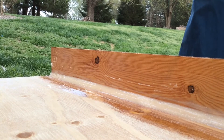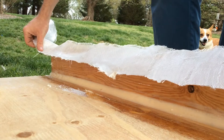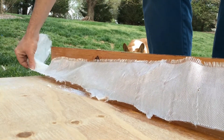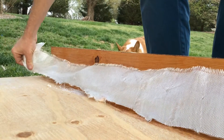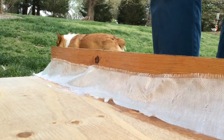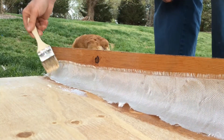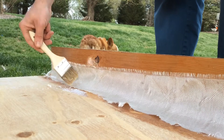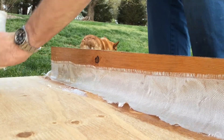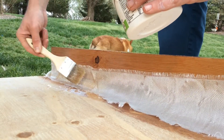That cornered angle thing that you just put in is called the fillet, and that reduces the stress that exists in the corner on the fiberglass, making the corner a lot stronger. Now we're just fitting the dry fiberglass cloth that's going to run like a ribbon and act as a tabbing that goes between the horizontal and vertical components. This is why we need the fillet — without it, the angle at the corner would be so sharp that the fiberglass strands would actually crack and break.